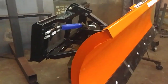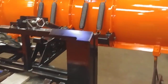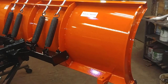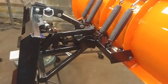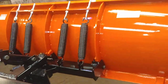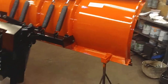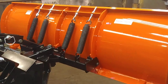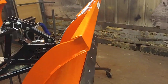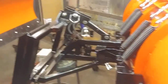If you were to put these on a scale—which we obviously have to when we ship them—the heavy-duty on a seven-foot plow is going to scale out at right around 640 pounds. As a standard duty in exactly the same configuration, because of that three-sixteenths box tube, we lighten that down to 570 pounds. So it loses about 60 or 70 pounds, up to 100 pounds depending on the size. Obviously if you're dealing with a machine that may only have 1,500 pounds of lift, you can gain a bit of control over your machine by going with a lighter plow.